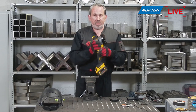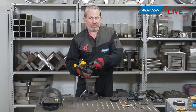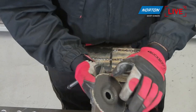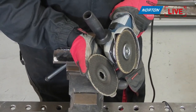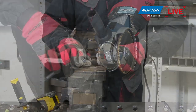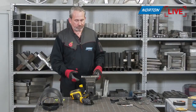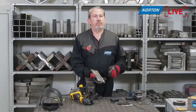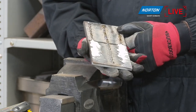The reason it's easier is quite simple: the contact area on the workpiece with a thin disc is different. The disc quickly adapts and gets a nice flat cutting edge on the periphery. Because it's three millimeters it breaks down really quickly and gives a nice flat cutting edge very quickly, so it starts to work fast. A conventional seven-millimeter disc takes a long time to dress that edge. Also, you don't scratch the material as much — three millimeters is more comfortable and lighter to use, and with the ceramic grains you feel more confident.